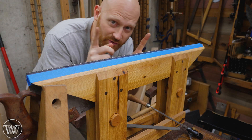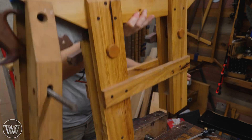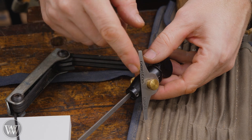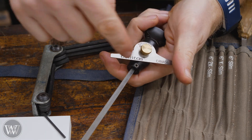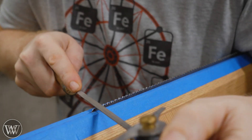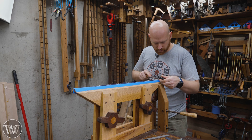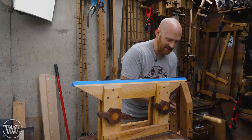Now that I've gone all the way from one side to the other doing every other tooth, I need to take this whole thing out and flip it around. One of the things I like about this saw vise is I can unclamp it, clamp up the whole thing, rotate it around, and now I can cut the other teeth. On the saw filing guide, I also need to rotate the fleam 30 degrees in the opposite direction, because we're filing from the opposite direction. Then just like before, go until the shiny spot disappears. And before you know it, that's the last one — and after that, we can take it out and give it a test drive.